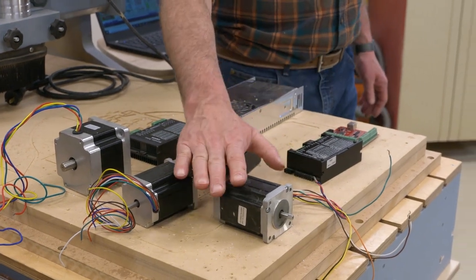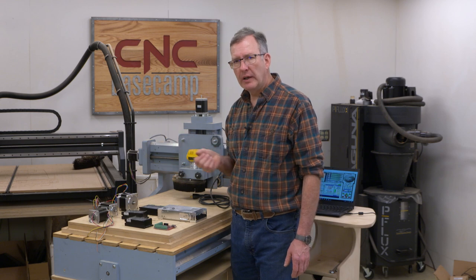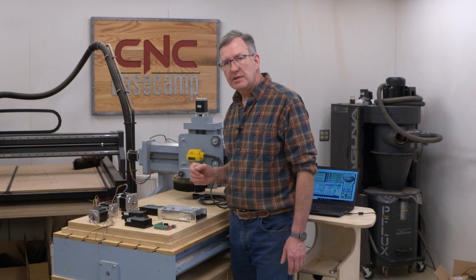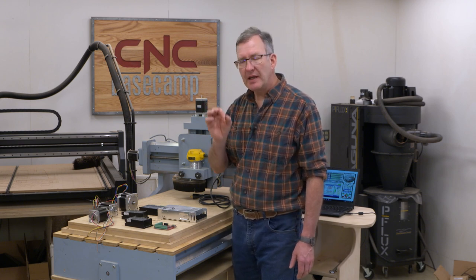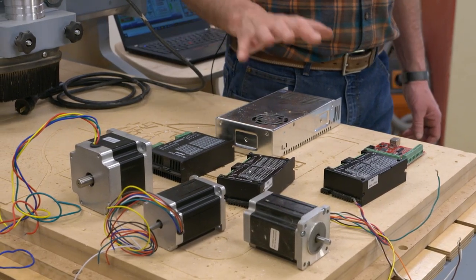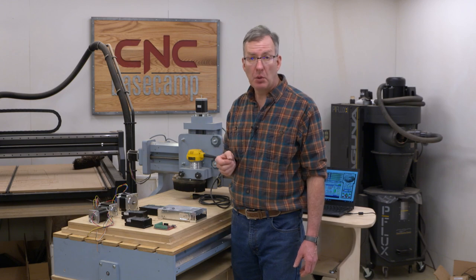The cables which are going to connect the motors to the drivers for this machine are what are called high duty cycle cables. Now for a lot of commercial machines, you're going to see a wire management rack holding the cables in place. Those have to suffer a high duty cycle as well, but for my machine, to keep things simple, I simply have the cables looped very loosely on the exterior of the machine. But the cables are meant to be able to go through cycles millions of times, so they're just the right cable for what we're doing here. One thing that is important is that you choose a cable that's shielded. Electromagnetic interference can always be a problem with a CNC machine. Electromagnetic interference can happen from dust collectors, any kind of motor, any kind of electronic devices you have functioning around them. And so shielding is important.